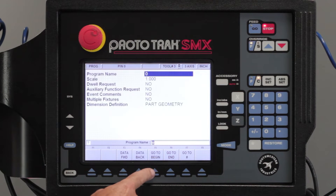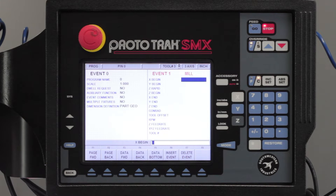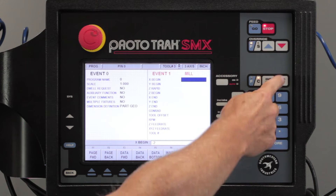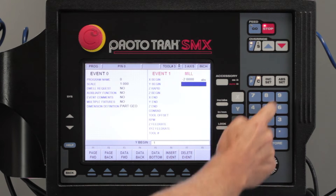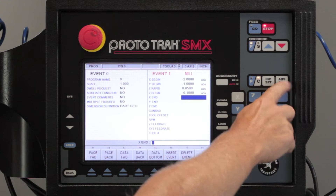To get started let's go to the program mode. Here I am at the beginning and it's asking what do I want to do for my first event. I'm just going to select mill. We don't use mill a lot in here because generally we connect the dots — we go from one mill to the next mill to an arc and stuff. But because I'm only going from one place to another it can be a straight milling event. So it's asking me where do I want to begin. I'm going to begin at minus two and minus one. Use my Z rapid of 50 and my depth of a hundred thousandths.